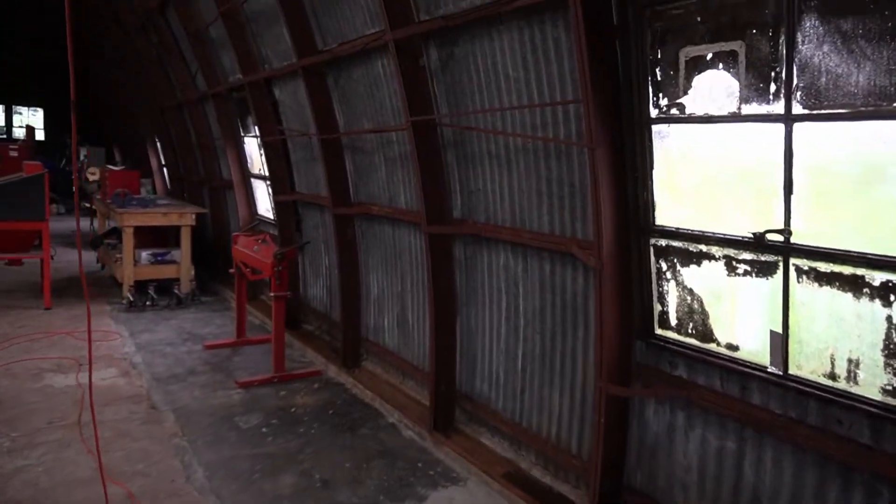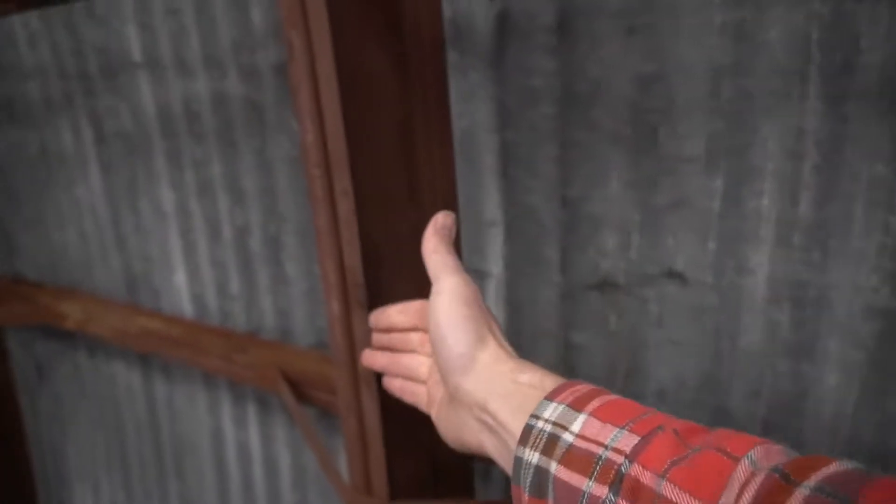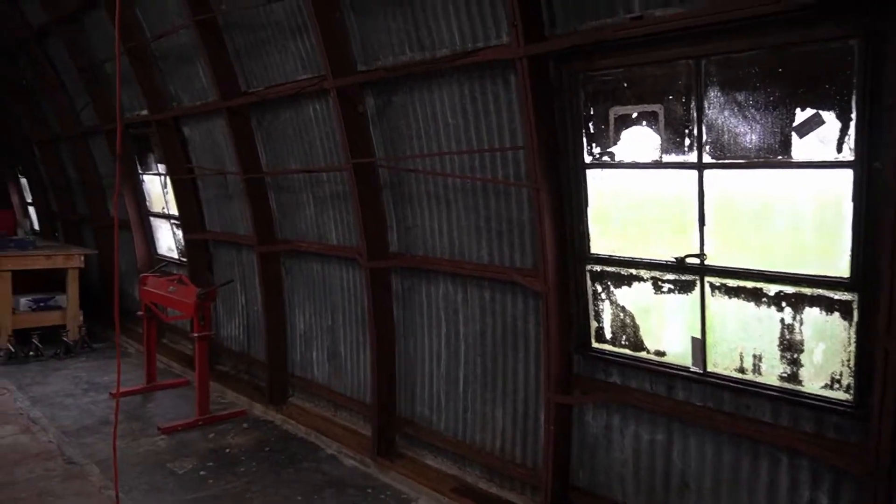This is all just old cable — it's sticky, and we've got some old boxes and receptacles. You can see that cable is sitting right on that metal — eventually that can wear out and you get electrical problems. I want to rip all this out and put in conduit or MC cable and then drop down some outlets. The conduit would have to run straight across or go up high and then drop down with bends. The simplest thing I think would be to run the MC cable and just ride it down and put an outlet that way. Let me know in the comments how you would wire this building — conduit or MC cable, where you'd put it, how you'd attach the outlets.